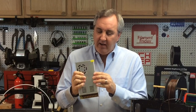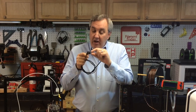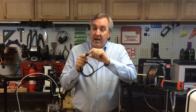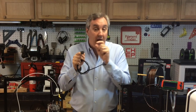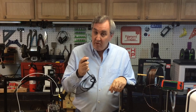It's still pretty safe but the three prongs are extra protection. Now if you have a two-prong plug like was on the TiVo, one should be wider than the other — in the US the wider plug represents the neutral, the one connected to earth ground, so you plug it in the proper way. With European blue and brown wires, the blue should connect to the wider terminal. If you get them backwards you're really messing up the system, which is why one is bigger than the other. But it's best to have three prongs so you get that grounded case — and that's where some people really mess up.